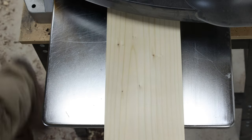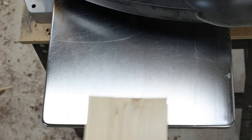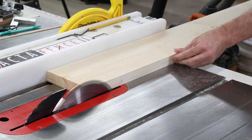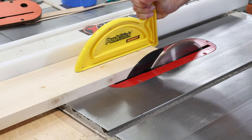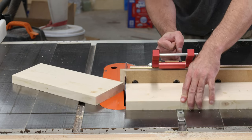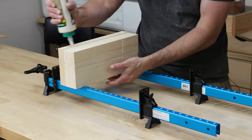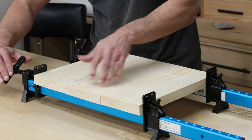Based off the pictures, I can get a pretty good sense of the size. It looks like it's just made out of pine and a couple pieces of oak, so that's not a big deal. Construction lumber is usually pretty wonky, so I'm going to do a little cleanup work and plane the boards to make sure they're flat, then glue them together since a two by six isn't wide enough. I'll keep the boards a little thick during the glue-up and plane them down to final size later.